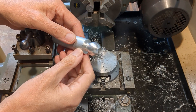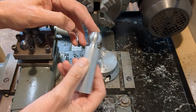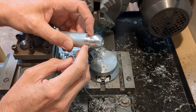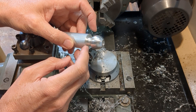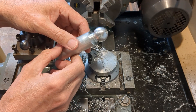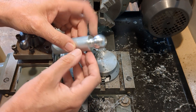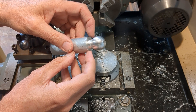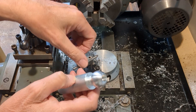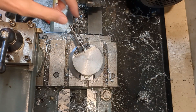Well, so far so good, but this has really been a relatively easy test. This is a softish aluminium. You can also see here that I've not really got in very tight to this collar. If you look back to my first video, the whole reason for making this is because I have another job in mind — I want to turn silver steel or drill rod, which is going to be a bit more demanding and will have a much smaller diameter collar. So before I go ahead and test this on steel, I really want to look at how this can be developed further.